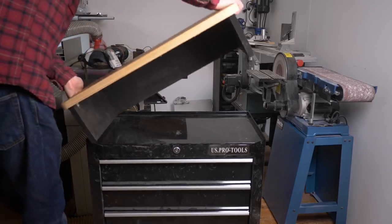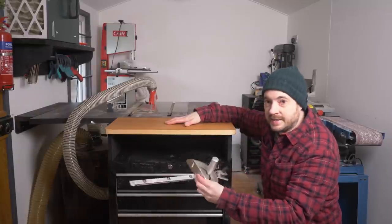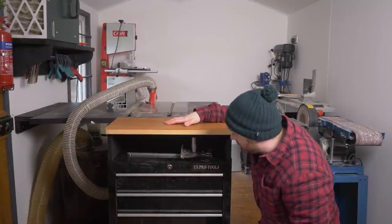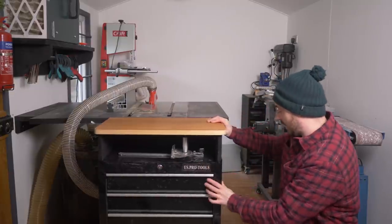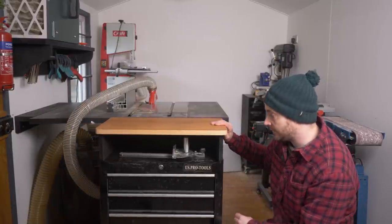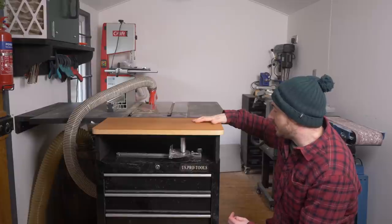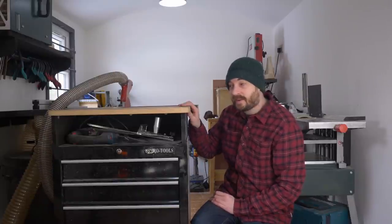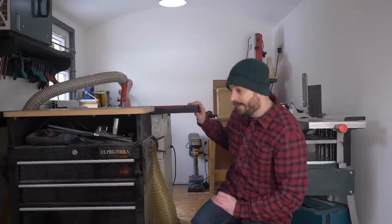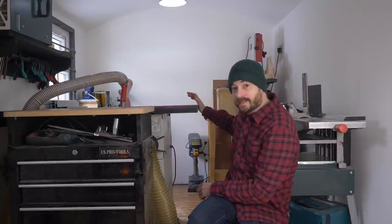That's all done and it just drops into place. There's a nice bit of storage space — I've got my mitre gauge in there with room for other jigs. It's got holes for a handle which I haven't fitted yet as I want to decide which side, but once fitted it can be easily moved around. It works great as an outfeed table, and if I wanted more space I could remove the homemade extension wing, then pull the cabinet around to the side for cross cutting support — it's the same height as the table.